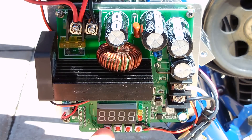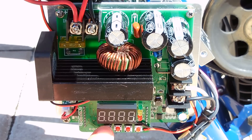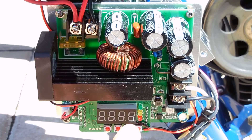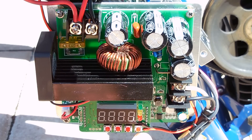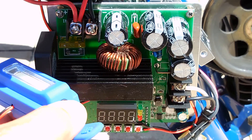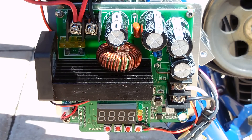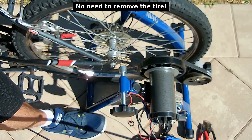Once you're done setting the voltage, push the set button once. You can do the same for the maximum current output — choose the current setting, push the button, adjust up or down, and set it. Once you start pedaling, the board will show the regulated voltage output, but you need to press the okay button to activate constant voltage. Instead of leaning way down to reach that button, I connected wires in parallel with it running to a remote button right under your seat, so you can trigger the entire circuit from a comfortable position.